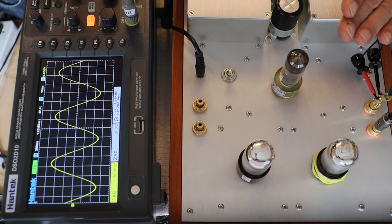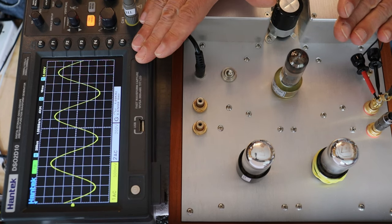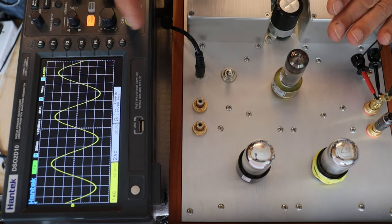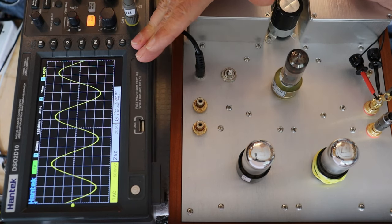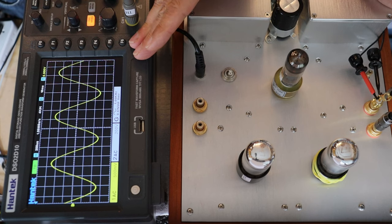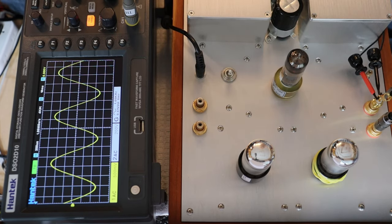when you're working with a scope, you've always got to take precautions. I can't go into all the safety operations of a scope, but make sure that you read your manual, and if you're new to working with an oscilloscope, that you follow some good videos online in which they talk about safety procedures, particularly voltage inputs onto the input lead right here, that's all the way over to here, you can barely see it. That's so that you don't blow up your scope, basically. These are fairly delicate instruments, but if they're set up properly and you exercise reasonable precautions, you won't have a problem. This scope's been on my bench for years, and we have yet to kill it. Okay, all right, so back to the test here.